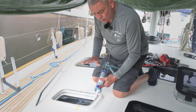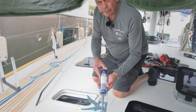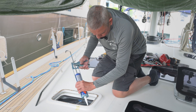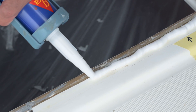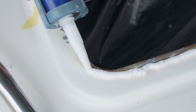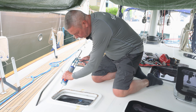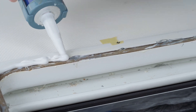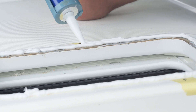At this stage, we've drilled all the mounting holes. What we need to do now is apply a nice bead of Sika 295 UV-resistant SikaFlex, and put a generous bead around the line of the screw holes. You want the frame to take up most of the bead — one continuous sweep around the hatch. Don't worry if it squeezes out when you're bolting the frame down, because that's what you want. Any low spots, just put a little bit more. You can always clean up the excess afterwards.